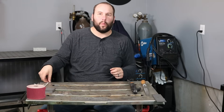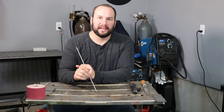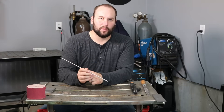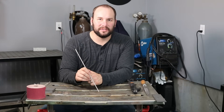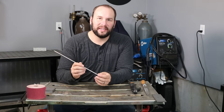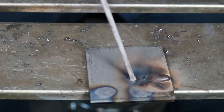Let's talk about why you have to strike an arc. In order to initiate an arc, you have to actually contact the center core of the electrode with your workpiece, and then as you come off, it makes a little spark that helps ionize the air so you can have a stable arc between your electrode and your workpiece. Until you contact those two together that can't happen — but why is that hard? Because as soon as you do, there's just enough heat that it wants to bond the electrode and weld it to your workpiece, so your rod will stick, and that can be so frustrating.